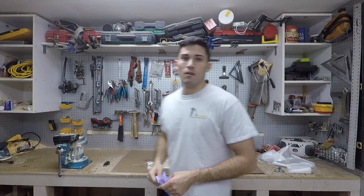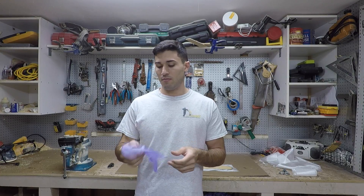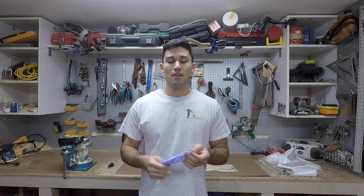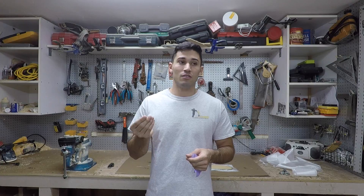As we build along I'll keep adding tips and tricks. Now that we're putting epoxy on parts, it's important to use gloves — not just because epoxy isn't great on your skin, but also because oil from your fingers will affect your finish. Even when the epoxy has cured and isn't sticky anymore, put gloves on before handling the part. If you pick it up and get fingerprints on there, when you go to do your final glass coat the oil will cause a dimple, which is really annoying when you're trying to get a nice smooth final part.